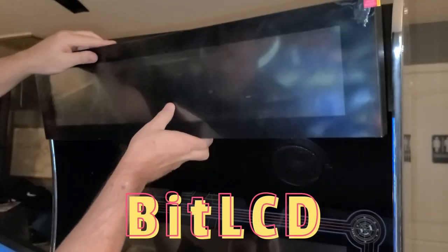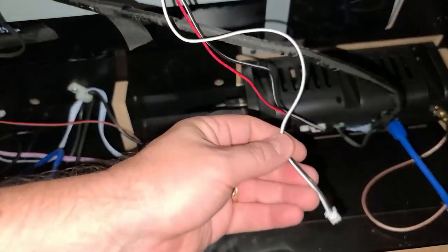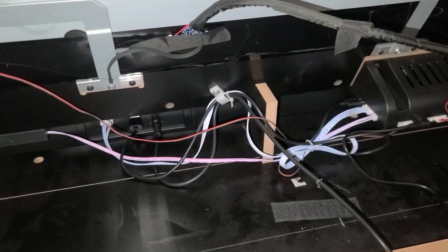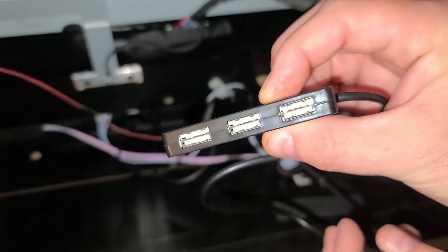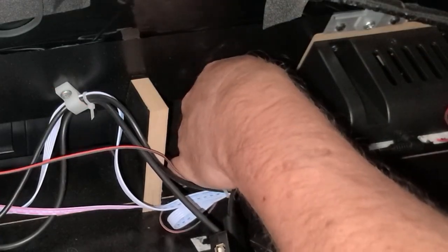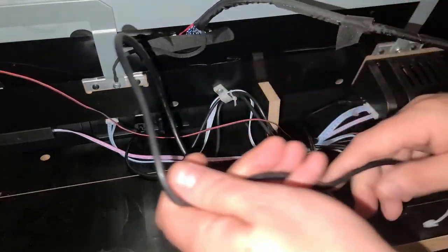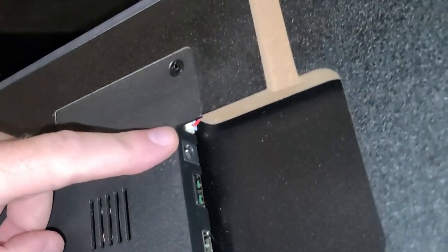Next I'll position the new Bit LCD over the screw mounts and go ahead and remove the plastic cover. Moving to the back of the ALU, unplug the small black and white LED cable as it's no longer needed. Now disconnect the USB cable going to the main board of the ALU. Then plug the USB cable going from the control panel into the side of the included USB hub that only has a single port, and connect the male end of the USB hub back into the main board of the ALU. Take the included long USB cable and connect it to the first port on the USB hub, with the other end connected to the USB port near the middle of the Bit LCD — the port near the power input at the back of the panel.